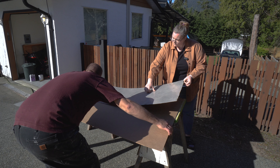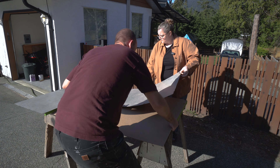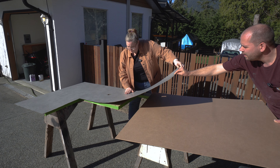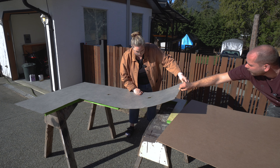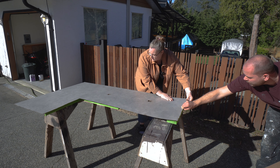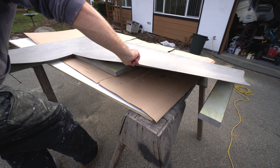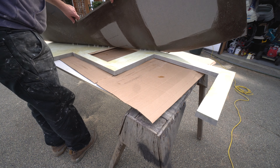If you're working with larger or more intricate pieces of laminate, you may need to put something between your layers of contact cement before you adhere everything. Because contact cement only sticks to itself, you can put something like wooden dowels or cardboard in between the layers before you set it, to make sure everything is in place and aligned properly. Having a second set of hands will also help with bigger pieces. If the contact cement on your laminate makes contact with the contact cement on your countertop in the incorrect position, you will likely wreck your laminate trying to remove it.